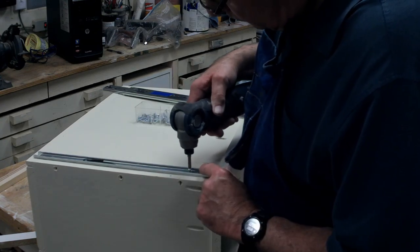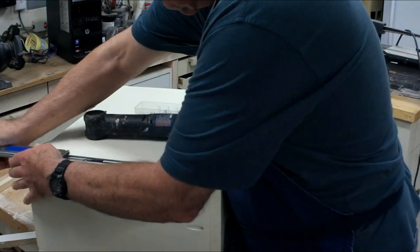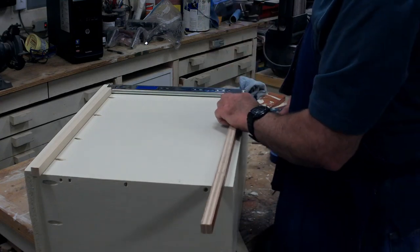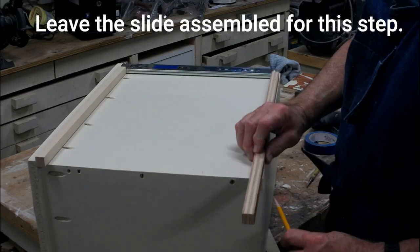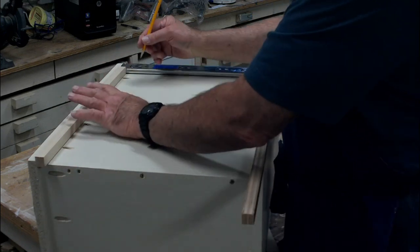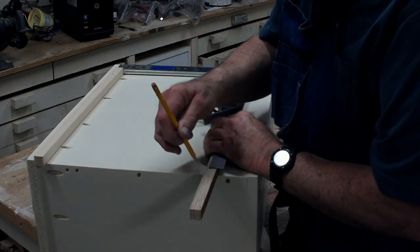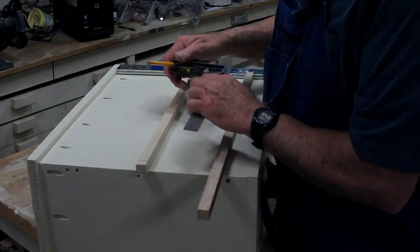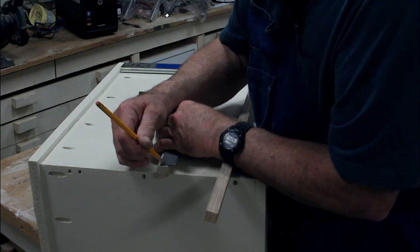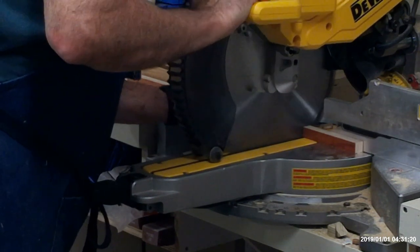I'm just going to install the front and back screw right now. After we have a successful dry fit, we can add the others. Put the two halves of your slide together on the drawer and make sure you have a good flush fit. We will use two square-cut sticks — put them against the front and back edge of the top slide, then mark the bottom edge of the drawer. Mark each stick so you know which is front and which is back. Now extend this measurement by the thickness of your slide — a half inch in my case. This will automatically position the slide on your cabinet wall at the correct height to allow space underneath for the bottom slide. If your slides are installed correctly, both measurements should be identical. Cut both sticks precisely at the saw and set them aside.